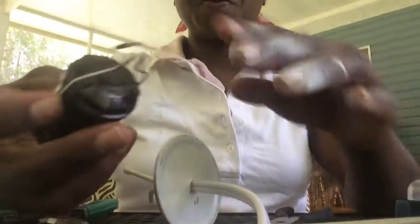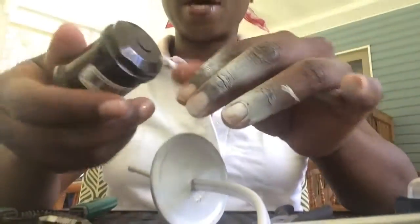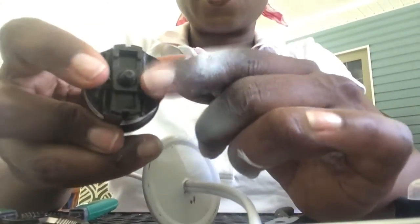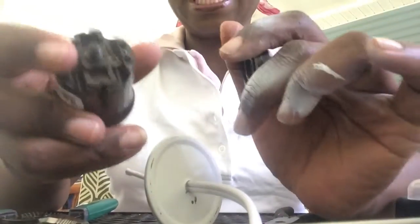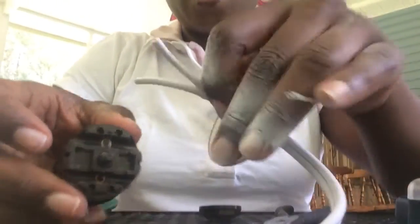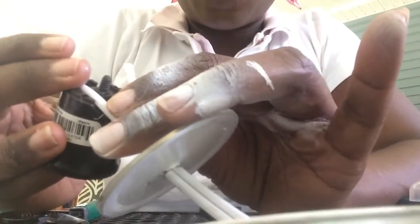Actually, with the type of socket I got you don't need to fully skin them. Let me show you this — we're going to take off this clamp. I do like it depending on the fixture, but in this case we don't need it. This is a screw-on base. I really like it because it makes sure that your conductors don't ever come in contact with the top of the metal lid, which could be potentially dangerous. So it's a lot safer. The way it goes in: you have your two wires already separated, and you put them on top of where it screws in — you see the two notches it fits into. It's going to go right in there.